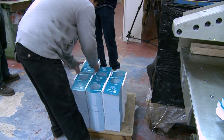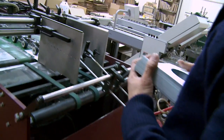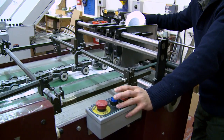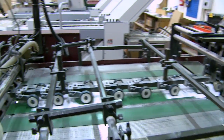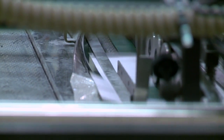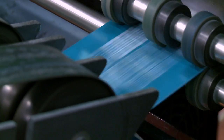The wallets are then stacked up ready for gluing. Each stack is then placed into the mole pocket folder input hopper. The wallets are then fed via rollers down the conveyor belt. Here you can see the section which folds over the gluing flaps as each wallet passes through.